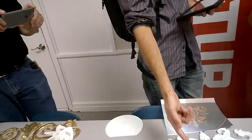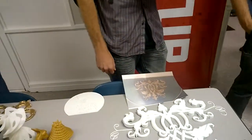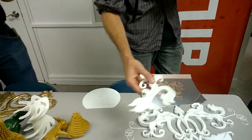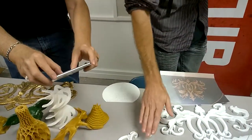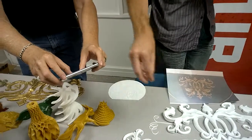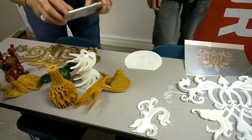It took a couple of days to print since I only have one printer, plus filament issues — so three or four days to get all the pieces out. Here's a fail so you can see: I was having heat creep issues, so I'd get like 90% complete and then it would just print in the air. I have dozens of these.